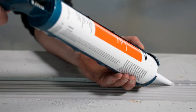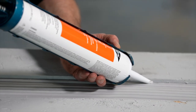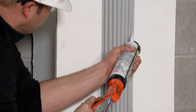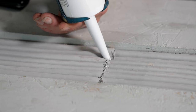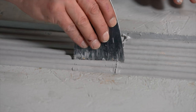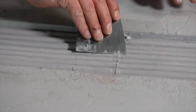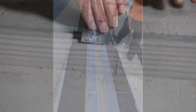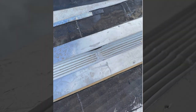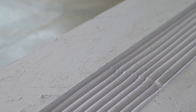Lastly, install a bead of the color match silicone caulk around the entire foam perimeter, sealing against the adjacent surfaces, and apply the color match silicone at the butt seams. It is very important to carefully follow the profile of the ribs to allow for the extreme movement that the foam is intended to address. Note: a solid bead line will result in pinched movement at the seams as seen in this image. This is how the seam should appear once complete.